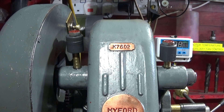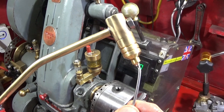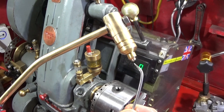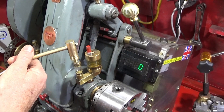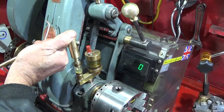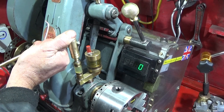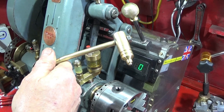So it's an excellent system now — less oil to waste obviously — and I can pump that oil into the countershaft bearing really well and wash out the old oil, inserting the new oil around the bearings. On the oil can, this front bore here seals on that O-ring, but I can also use the tip here to fill up the main bearing on my oil manifold, so it still is a multi-purpose oiler.